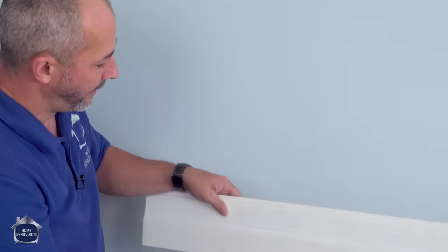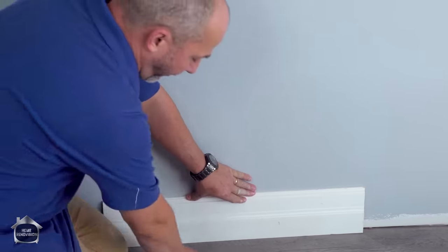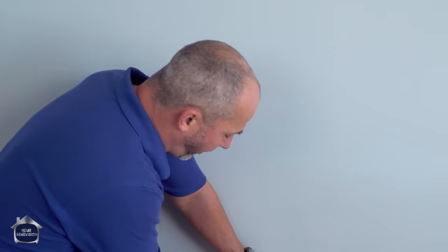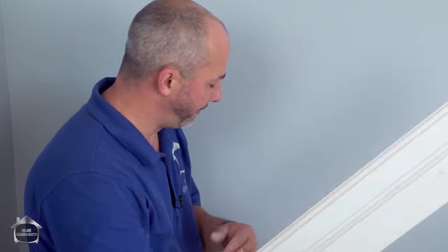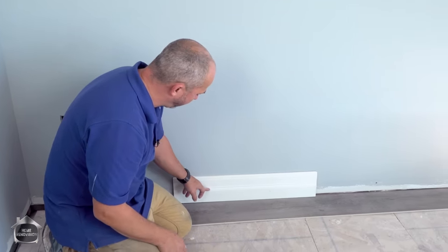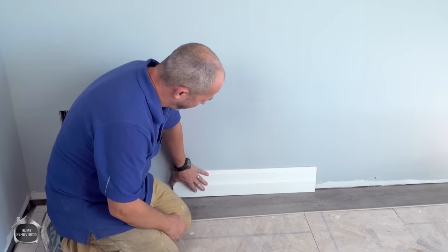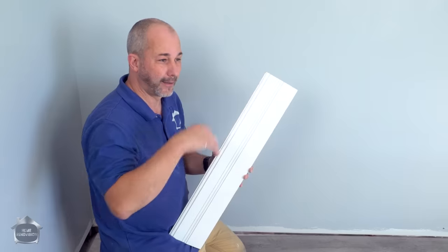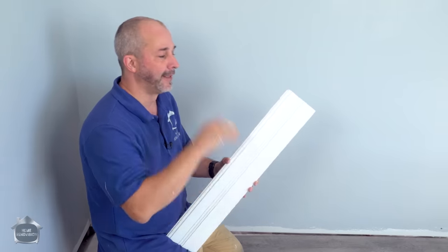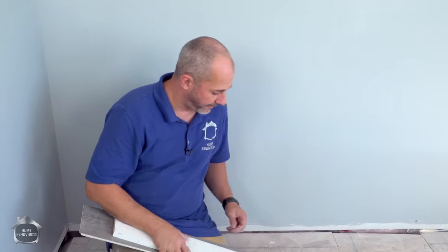There's no way you're going to get a thick piece of wood to follow the contour and close all those gaps. In new homes you could put the flooring in first and then put all your trims on. But in older homes like this, the walls have too much curve, and even with floor leveler in places it's really difficult to guarantee you can manipulate the board. So I put all my baseboards on first — painted, with adhesive on the back — stick them on the wall and throw in the odd brad nail. Then I can put some 45 compound in the detail. This is why I'm installing with a gap: I've got probably two days of touch-ups, and while I'm working on the paint I can also do all the trim.